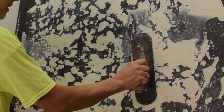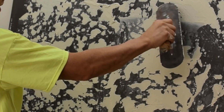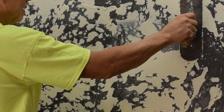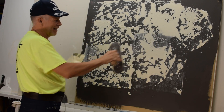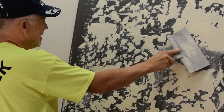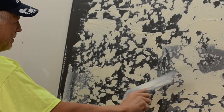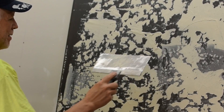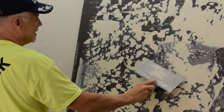Now I'm going to show you these sand lines — the sand makes it chatter, and that's kind of part of this texture. Or you can lay the trowel down a little bit more if you want, and that smooths it out. If you decide you've got too many chatter lines, really flatten it out and go across it and it'll take out some of that chatter. Also, if you get a knife mark like that one right there, you can always just go back over it real lightly and just take those out.